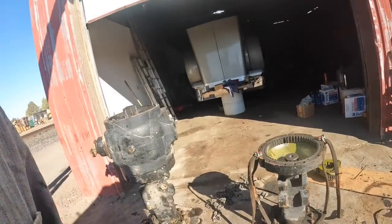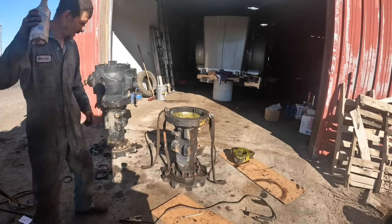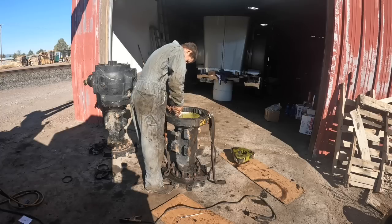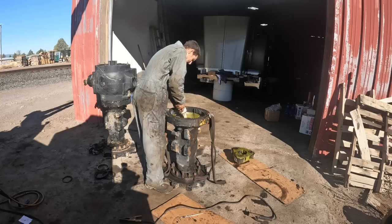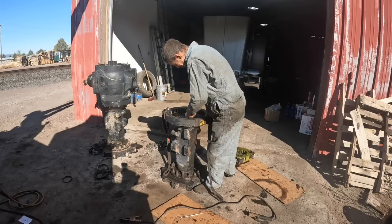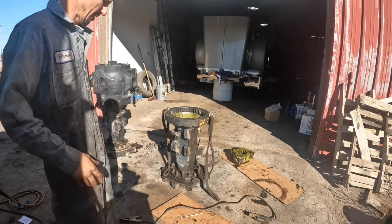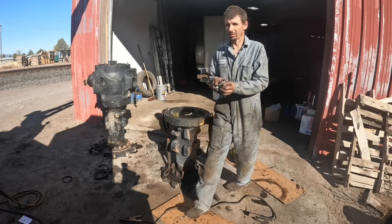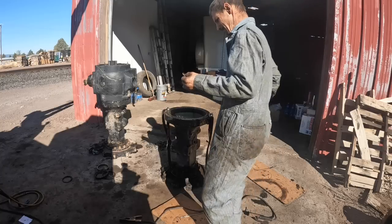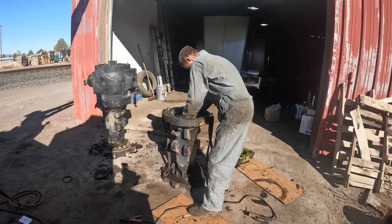And so now I'm going to pre-lube that bearing a little bit, get it wet. It's probably going to smoke and steam, but at least it'll have some oil of some kind in there. So now, the planetary, this brown shim goes on the inner race of the bearing. I'm actually going to turn it, I think, like this.